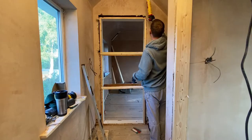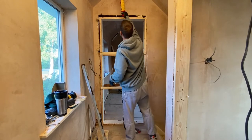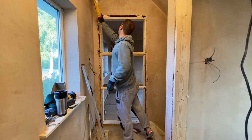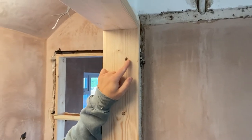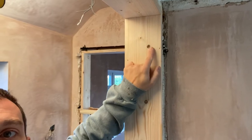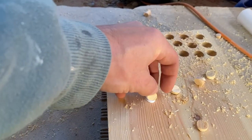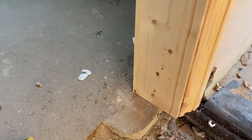Cut the wedge with a multi-tool or hand saw — that's what will make the frame really solid. At the very end, when it's all sprayed and the expanding foam has cured, you do a few screws. I've done a special hole — I'm gonna put a wooden plug in it and fill it in with glue, so when they stain it they won't see it. Three screws is enough in my opinion.